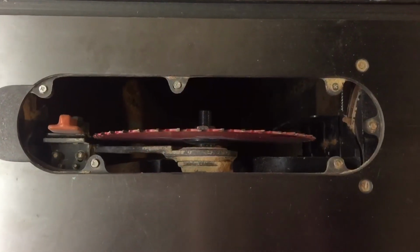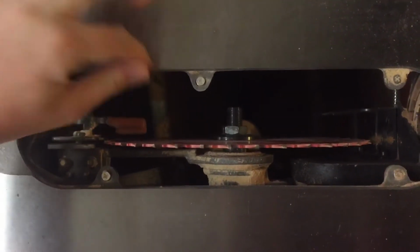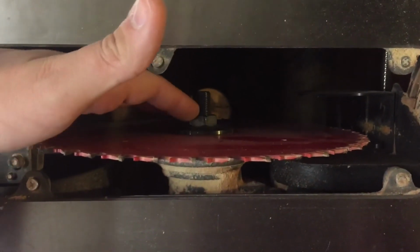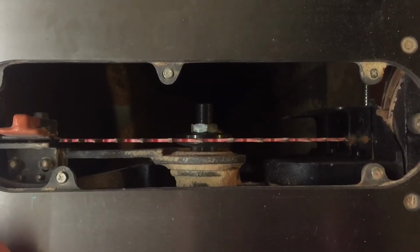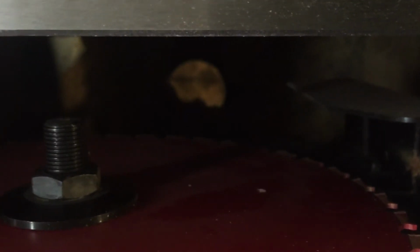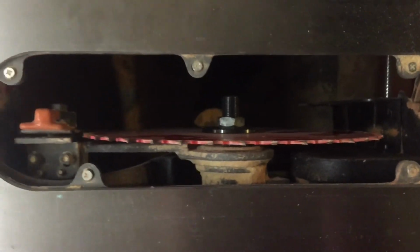If we take a moment to look down on top of the blade, you can see that this was the lever I was talking about for unlocking and removing the riving knife. A simple nut system on the trunnions here is for removing this and installing different blades, or a dado stack. And if you look down inside the drum, it's conical and hard to see here, but there's a nice 4-inch diameter circle at the bottom where all of your sawdust falls out. You can either attach a system for vacuuming, or you can let it fall to the ground and sweep it, much like I do.